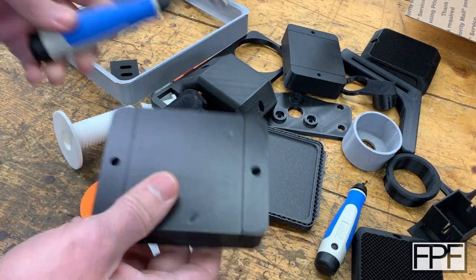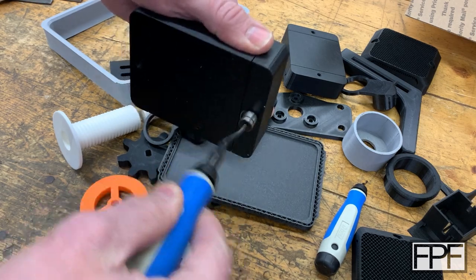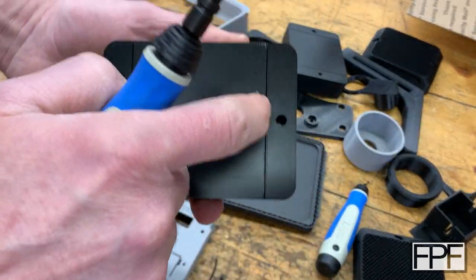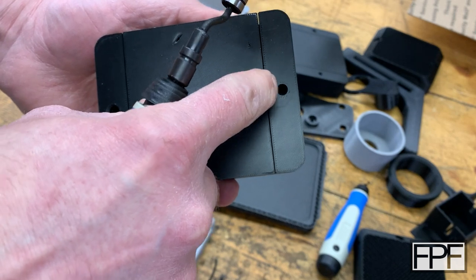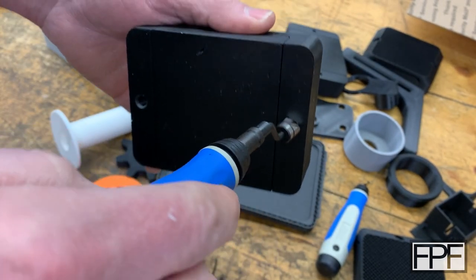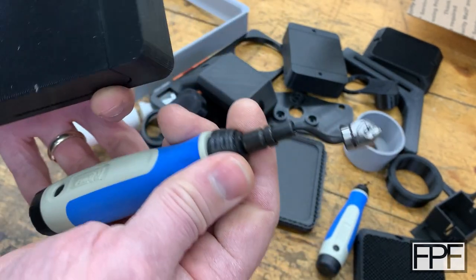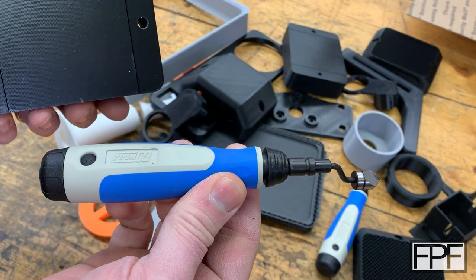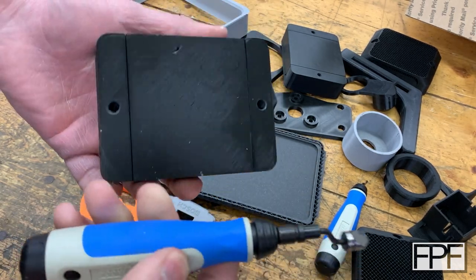Noga does make a different style of deburring tool — this one just goes in there and then you rotate like this, and that'll clean that up really nicely. If you keep pushing, you're going to have a nice chamfer. If you just want to take the burr off — this is the piece that would be flat against the bed, so if this was a hole with really tight clearance, it's probably a bit tighter down where it was against the bed because that plastic was squished more on that first layer. So not only can we put a nice chamfer on this, we can open that up. I have historically just used the same one I have for metal, and it's been okay. Ideally you'd have one for plastics too.